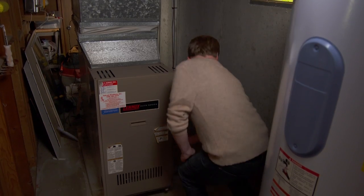Richard explains a device that reuses the existing two wires while providing full internet accessibility. It splits the smart thermostat into two pieces: a user interface upstairs and a base module at the furnace. The two wires — formerly just a switch — now act as a digital highway and carry power from the base module up. Future expansion for AC, ventilation, or humidity can all be wired out of the module.